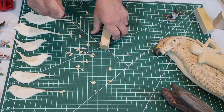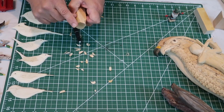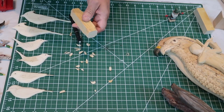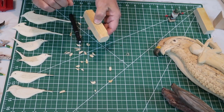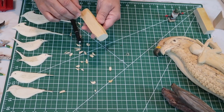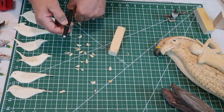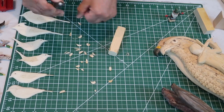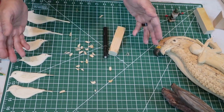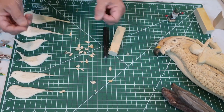Keep a sharp blade. If you see that this surface is not smooth and you start to see it a little bit rough, that means you're crushing the wood instead of carving it. That is dangerous — that's when you're going to get hurt. You switch out your blade, put in a sharp blade. And later, for more advanced techniques, I'll talk about sharpening knives and using different carving knives.